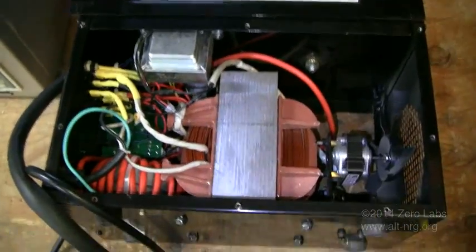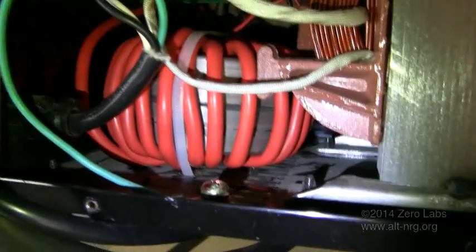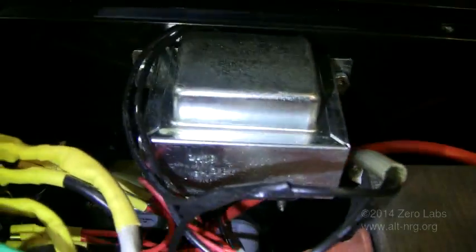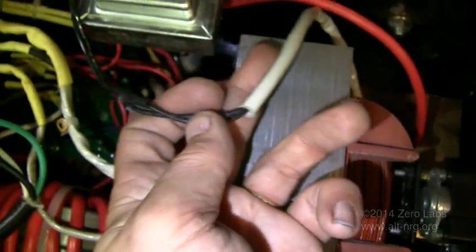Looking at the opposite side of the MIG welder there's a lot more space. You can get another look at the transformer. The core is two toroid cores stacked on top of one another with 27 turns — all I could fit — of number 8 gauge heavy insulated wire. Probably could have used slightly thinner insulation to get more turns on, but it is what it is. And here is your transformer screwed to the bottom side of the upper deck. These wires lead to the cooling fan at the back of the MIG welder.